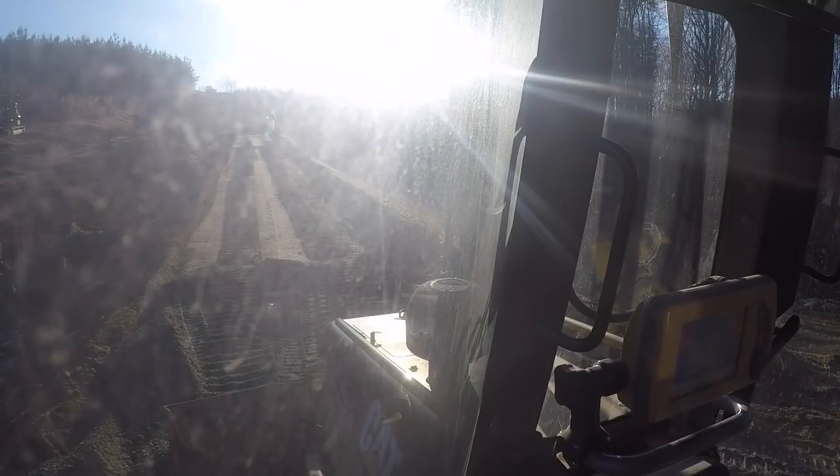I was at a negative 0.98 with my subgrade, which made the rover read that I was at the correct depth. The rover is the handheld GPS unit, and it is the authority. You go by it. So now that I've added back my stone depth, which is 6 inches for now, and then eventually it'll be 8 inches, but right now it's 6 inches, I have a negative 0.48, and that's what we're going with to start with.